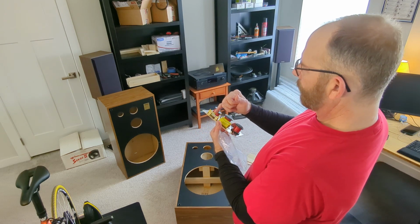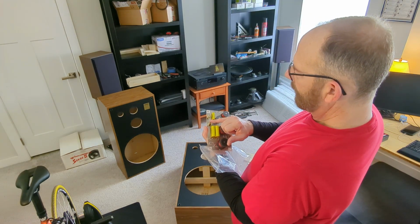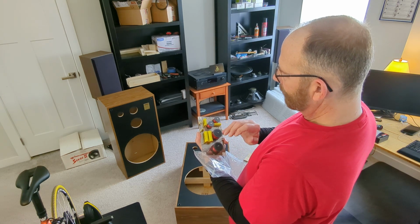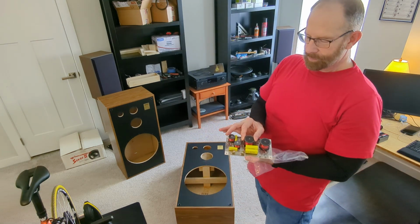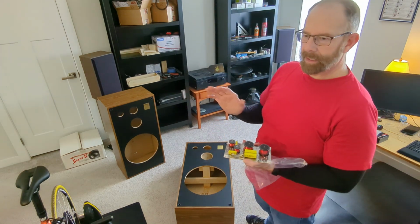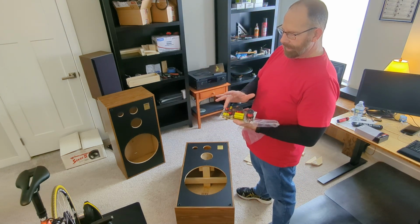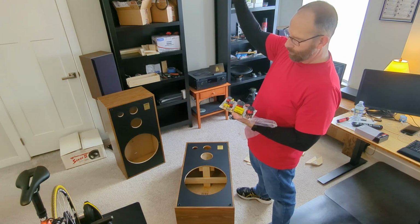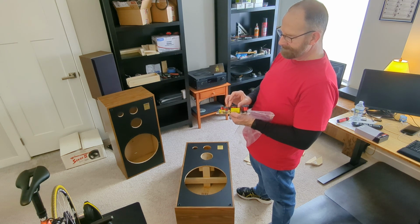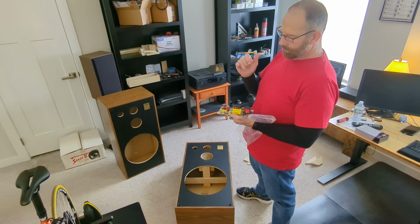In case you're wondering what this is for, this essentially is like a dome light in a car, and it protects the high frequency band, which is really cool. Matter of fact, some of the older speakers that I ran, the Eminence versions that had these in them, I used to run them at say 2500 watts RMS. These things would be glowing. You could see them through the ports, almost like a disco show inside. So they do handle some energy. And if they ever burn out, chances are that'll fry before your tweeter, hopefully, and you can replace it.